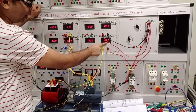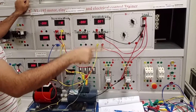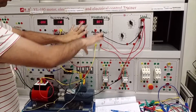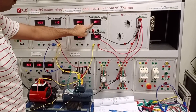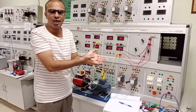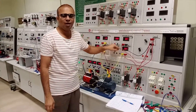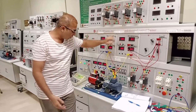The armature current reading is 0.07 amperes — this is simultaneously the load current, the series field current, and the armature current, confirming the whole load current of the electrical machine is 0.07 amperes. The generated terminal voltage is 7 volts. To calculate the power generated in the armature or power delivered to the load, multiply 7 by 0.07, which allows you to easily calculate the power in watts.